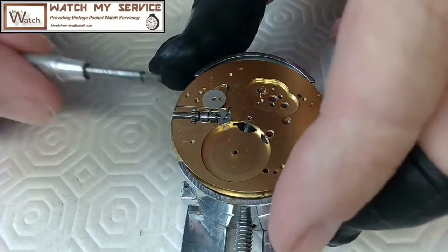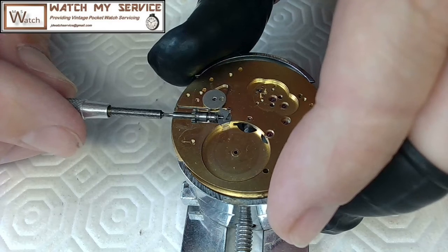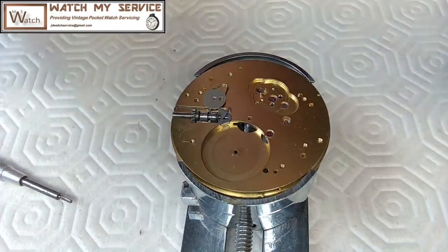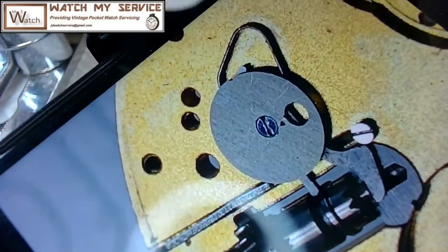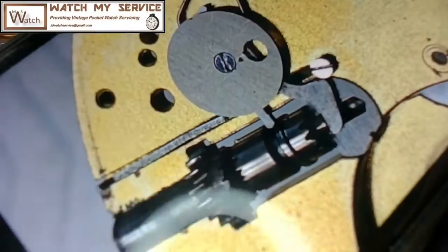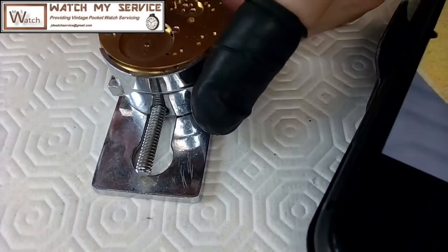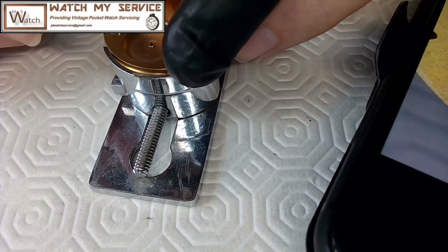I just want to do one more thing — you saw I put a bit of oil in the head of this thing here so I could push this up. The spring seems to be working well, it's in the right place, and I double-checked the length of the spring here to make sure that when you're putting it together this one here is actually connecting. If I look at it in the open situation, I can see the slightest bit of curve right there, which means not all of the spring is all the way in. It seems to be working fine. It's a great little mechanism that's lasted all these years.